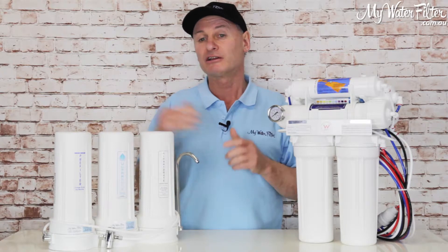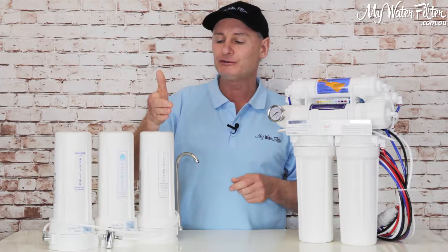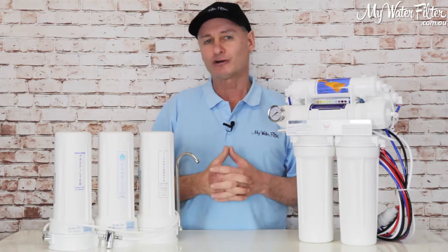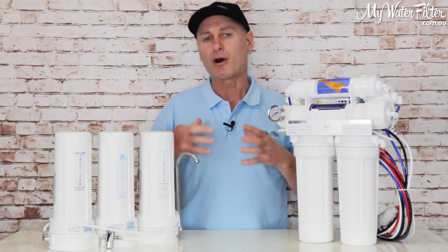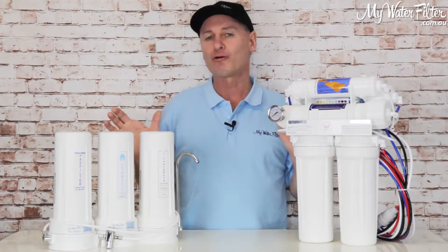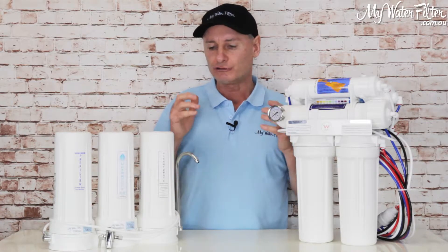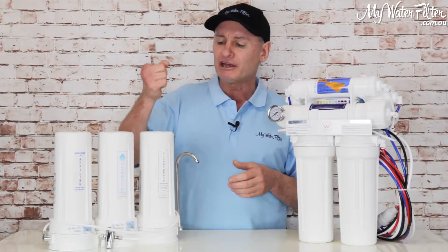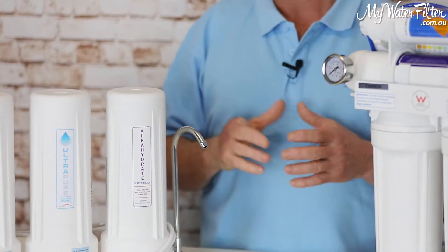The lime coming out of the concrete walls is elevating the pH of your water. If you have any other type of water tank — poly tanks nowadays are used a lot, bolt-together steel tanks with a big liner bag inside, basically any tank except concrete — there's no lime leaching out of the walls. So you've got no way to elevate or alter the pH of the water, and at that point it's good to have a third cartridge.